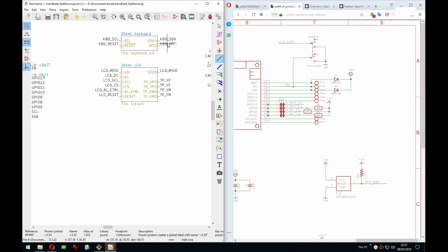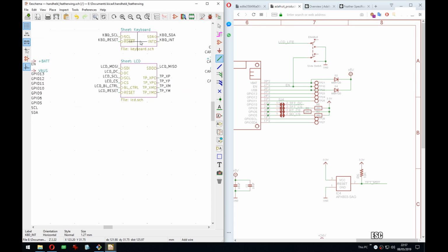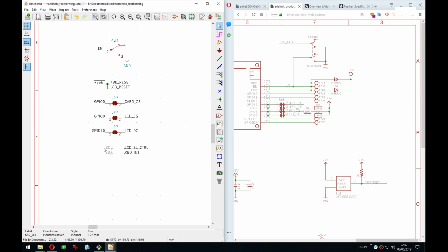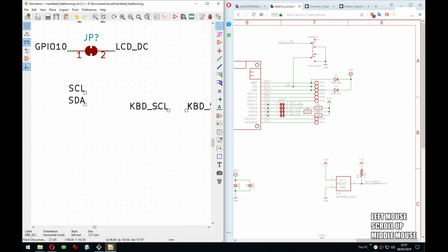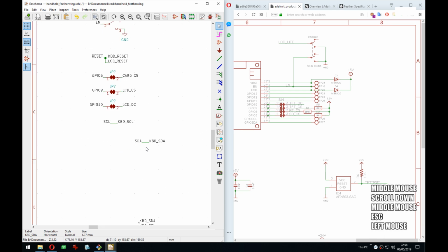So we still need the keyboard interrupt, possibly somewhere. Right. The pull-ups on the I2C. Yes, I decided to put them here. So we do that. Wait, how did this happen? Did I seriously just copy the 2 exactly wrong pins? There's no good way to do this nicely.